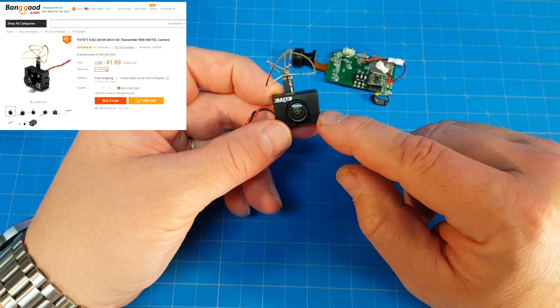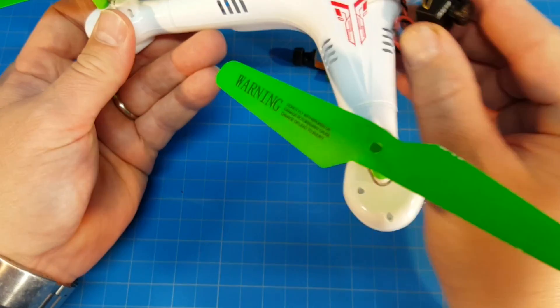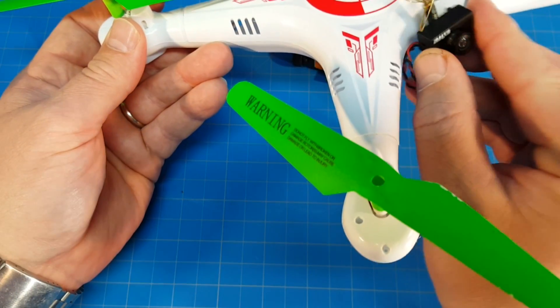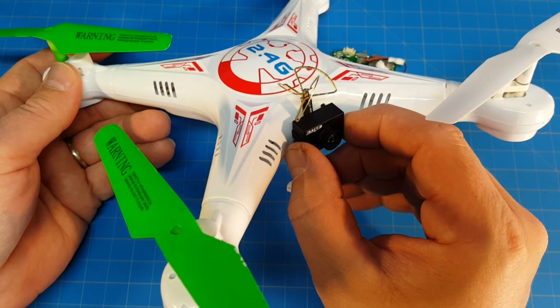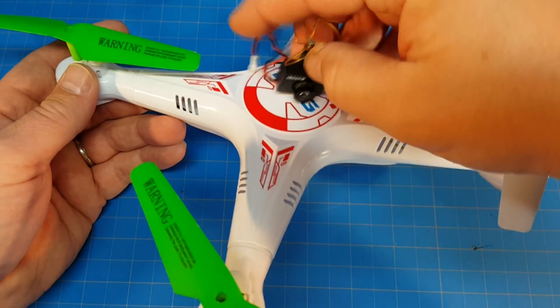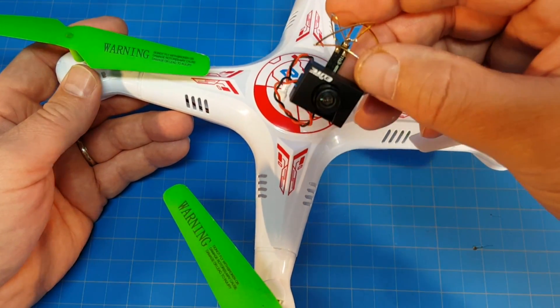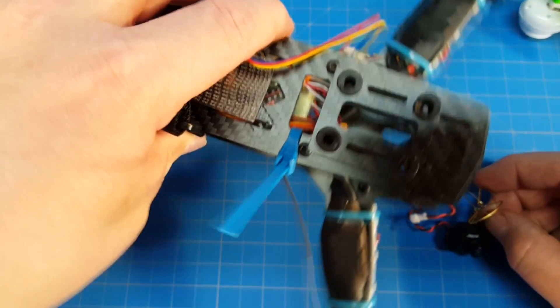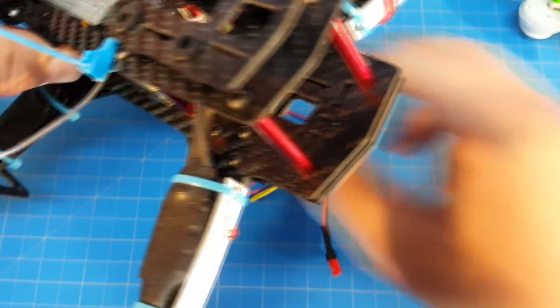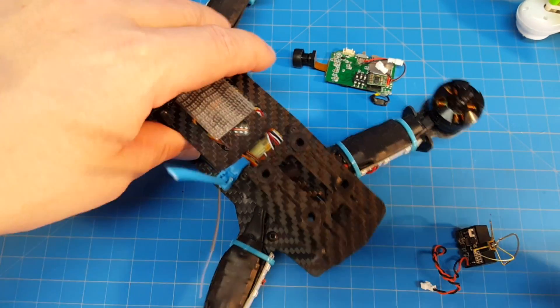So you can get this for $41, it doesn't need a voltage regulator so you save $5 there, and you can just mount it on the front with some foam tape. It'll work just fine — you'll get some prop in your picture but we always kind of do — or you can mount it on top if you want, though that exposes it to crash damage. Again, we can take a toy quad with an inexpensive camera and get involved with FPV without spending lots of money. A 250 quad — you're going to spend anywhere from $190 ready to fly, and then if you start buying higher-performance motors and factor in prop costs, your costs start going really high.